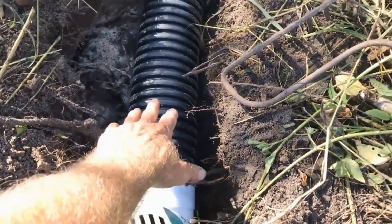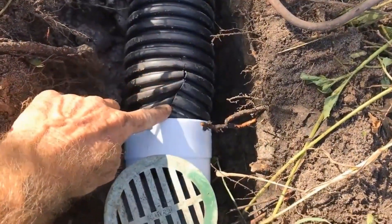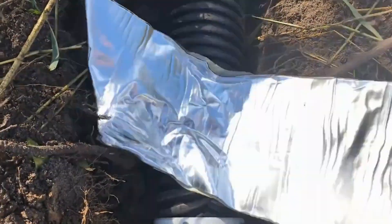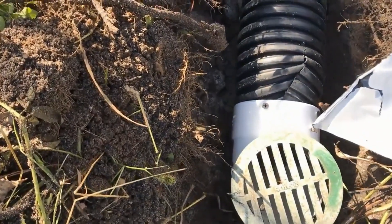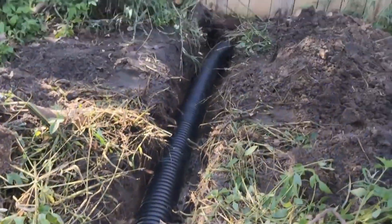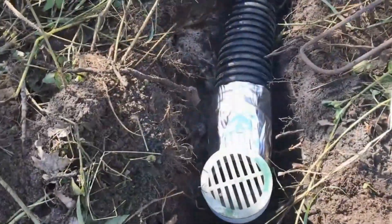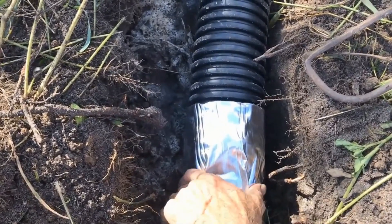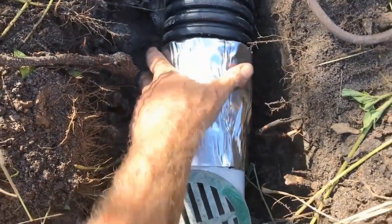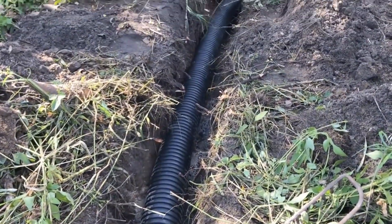At the discharge, we're using a four-inch corrugated pipe with a four-inch 90-degree fitting. I slice it inside the coupling, put a couple of set screws in, then use roofing tape — window and door flashing tape with real sticky rubber on the back — to wrap the entire coupling. It doesn't have to be perfectly watertight since we're discharging, but it makes it look good and secure. Water travels from the foundation, comes under the fence, and floods out into the area. That seal will never come off once it sets.